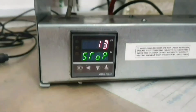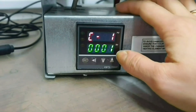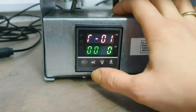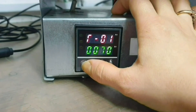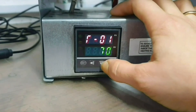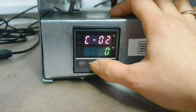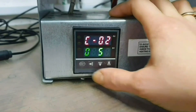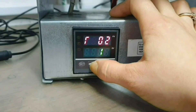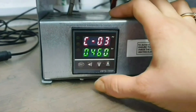Now I'm entering the program. Please press SET — that is the starting point. Press SET; these are the time parameters. Now by my chart, I need 60 minutes to get to 450 degrees. Set. Hold for 10 minutes. Set. Soak at 450 degrees.